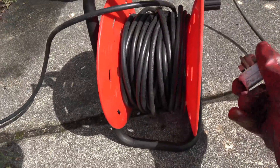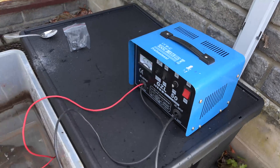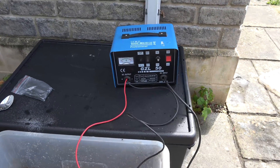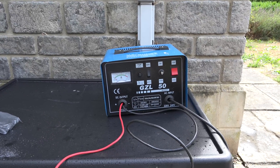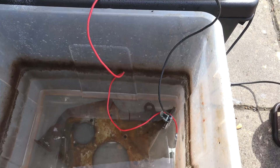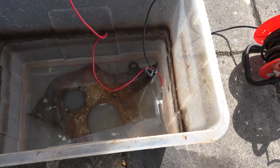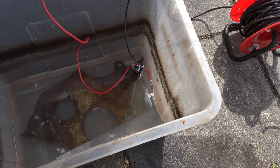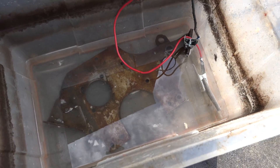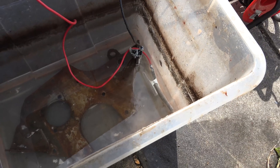Right, one-handed - okay! The amp meter went up, which is good - that means it's drawing something, so there is a current flow occurring. Electrolysis is occurring at about two amps at 12 volts on minimum. It's fizzing on the exposed edge closest to the anode, so it looks like proximity matters. It's definitely going - the closer bit is fizzing the most, so maybe we'll have to rotate it around, but so far it appears to be doing what it's supposed to do.